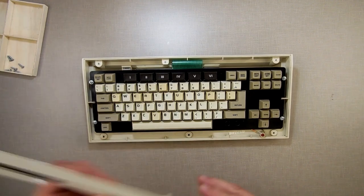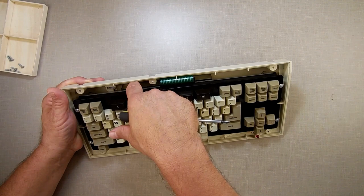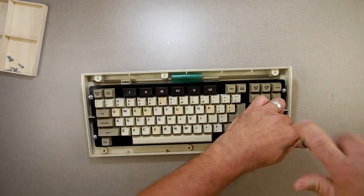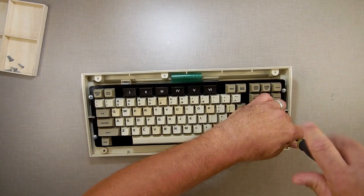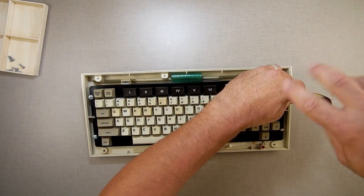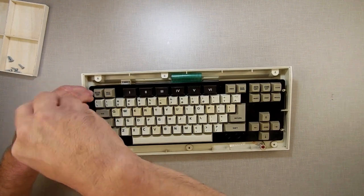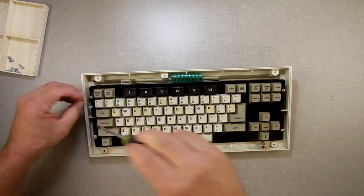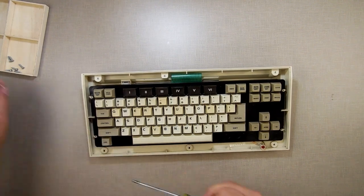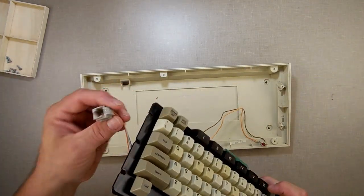So what we did is I unscrewed that, pulled that off there. Now, see, the keyboard is here, and this membrane goes down into a little computer that's actually in it. It actually is a computer. There's a 6801 microprocessor in there with 1K of read-only memory built into it. And its sole purpose in life is to wait for a message from the Adam on the AdamNet saying, hey, device, I believe it's 15 keyboard, device 15, you got something for me? And at that point, device 15, oh, this is loose there, that's not good.